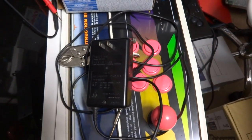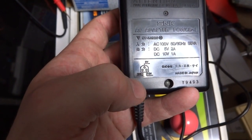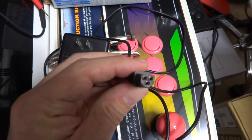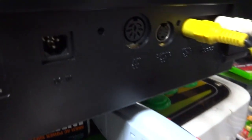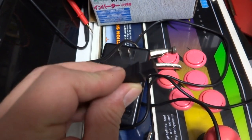As well as some simple things you can do at home to try and get it running. If you take a look at the bottom of this power supply, you'll notice that it has three prongs on it — a plus 5, a ground, and a plus 10 volt. On the end where the adapter is, this plugs into three pins on the Neo Geo CD. If we take a look at the back of the Neo Geo CD, right in here you can see the three prongs it plugs into.